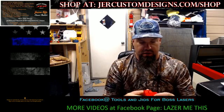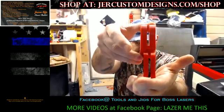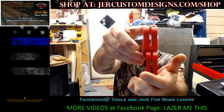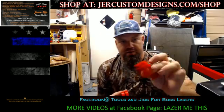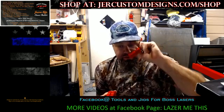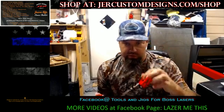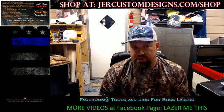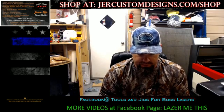First thing is the side profile. You can see that I've removed quite a bit of material from it, and in doing this, I've allowed for more room on the bed, especially for smaller machines, because this has been upgraded to include all machines. So even if you have a 3655 like I do, it'll still help save some room on the bed. And if you have a 1420 or 1416, it'll allow you to use it without taking up too much real estate that's otherwise pretty valuable.